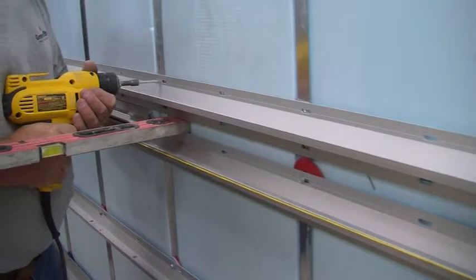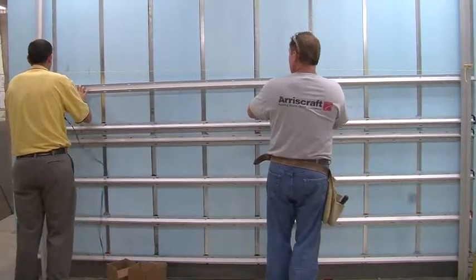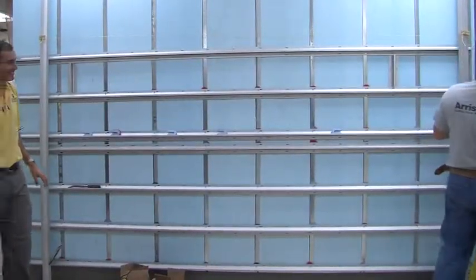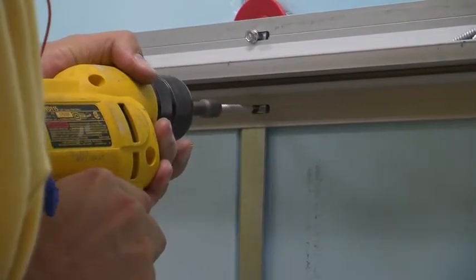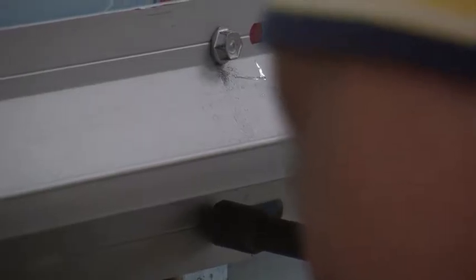When you hit the point in the wall where you intend to use a bullnose or a 4-inch stretcher, set the beams an inch apart. Then continue up the wall, keeping the channels a standard 9 inches apart. Remember to put a screw in both the top and bottom of the channel along each z-channel.